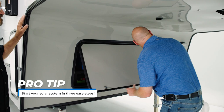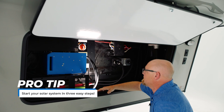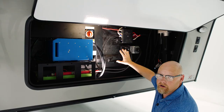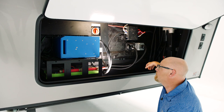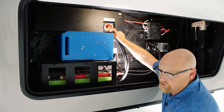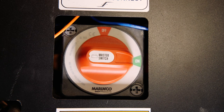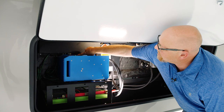So if I'm going to start in here, I've got to open this compartment up. And then this is my 600 IL system. The first thing I need to do is turn on the battery disconnect for the coach. That gives you 12-volt power to the entire coach — that's your main disconnect instead of having what you used to have in your wet bay on the side of the unit. Next thing I need to do is turn my inverter on. This is the inverter disconnect — it provides 12-volt power from the batteries down here to the inverter up here.